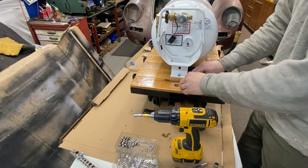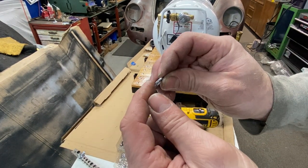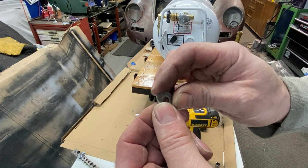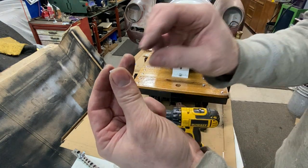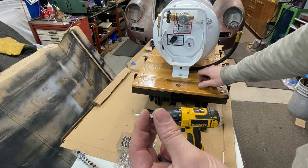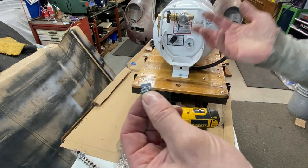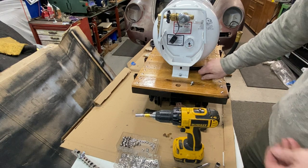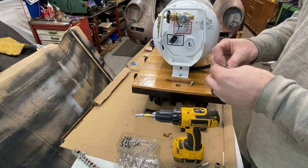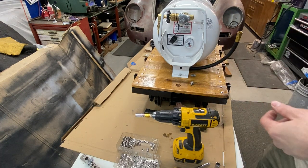There's an engineering standard for washers worth pointing out. When you get a washer there's a sharp edge on one side and a kind of rounded, more finished edge on the other. If I recall correctly, you face the sharp one away from the thing you're clamping to, so the rounded edge is against the metal or wood — it's less likely to dig in and cause a problem. That's probably way overkill for this, but on an aircraft it could be a real issue. Useless fact to clutter your brain — you can forget your phone number but now you know about washer orientation.